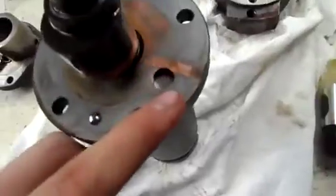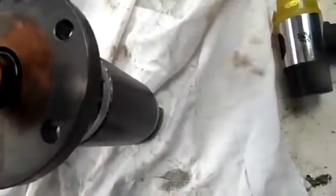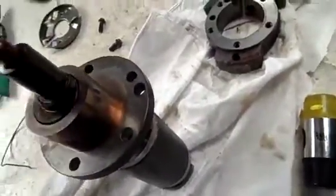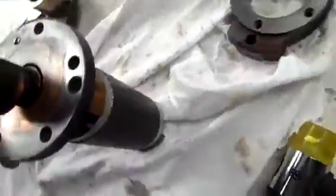I'm guessing for the time it was probably in an air conditioner it's been worked pretty hard, because there's a lot of wear on it — especially down this outer edge here from where the rotor may have even started to move at one point. As you can turn it over you can sort of get the idea of the oscillating motion in the eccentric. It's a very nicely made bit of kit, very hard as well. I'm guessing it's possibly tool steel if not high carbon — yeah, very hard stuff.